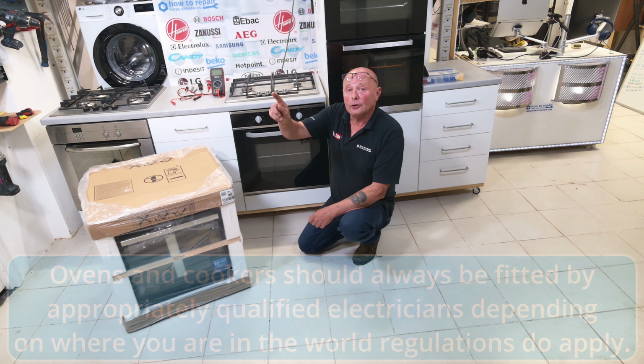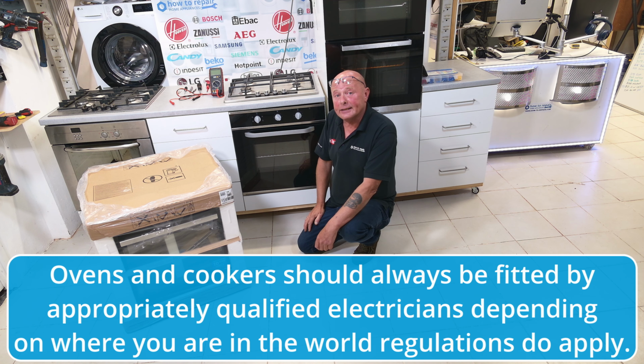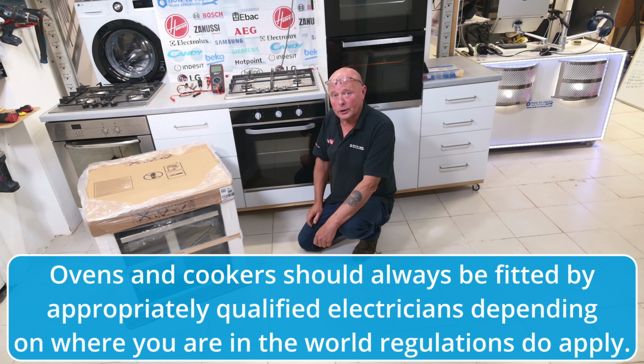If you have a single spur cable coming to a cooker, but someone has added an additional socket to that spur which they shouldn't have, or you may have an extension lead running to the appliance and the cable is inadequate. What can actually happen when the cable is overloaded? It is unable to carry the amount of amperage to the cooker. Therefore, you end up with what you call voltage drop. This can cause havoc with new modern electronics.